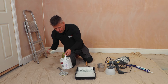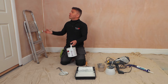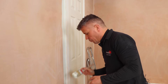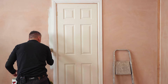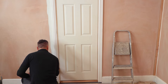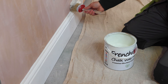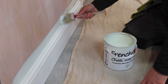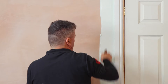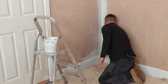What I'm going to do is take my brush and start to cut in right around the edges and along the skirting board and around the frame on this one wall. At this point I don't have to worry about cutting the paintwork in on the plaster that meets up to the frame itself — I want to cover the plaster and then go over onto the frame to make sure I cover all of my filler. I'll do this a couple of coats and once it's dry I can cut in my frame potentially with a different colour. Of course, if you're not painting your frames or skirting boards you would have to mask along the edge and cut it in neatly.